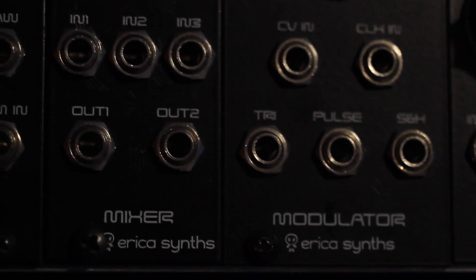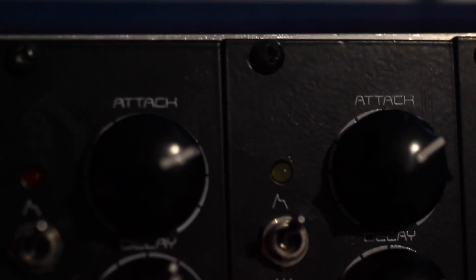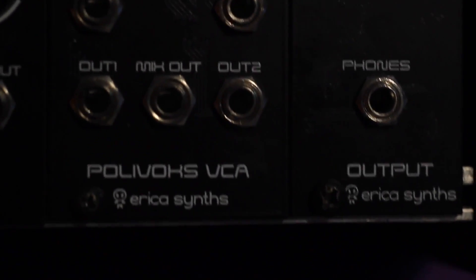I'm actually making these videos after having built the entire set. I now have a good grasp of the Erica Synths style of design for DIY. I've developed a procedure with logical steps which pretty much works for all the modules. I'll include a PDF with these steps in the video description for quick reference. I also recommend a particular order for building these, especially if you're a beginner. Don't start with the VCO, as it's one of the more complex builds in the bundle. You should start with the envelope generators, the mixer and the filter, which are very easy single board designs. Then the output module, the modulator and the VCA. And finally the MIDI to CV and the VCOs.